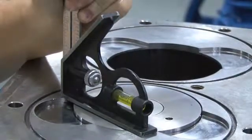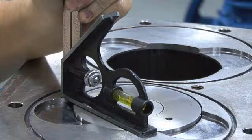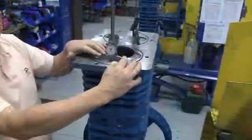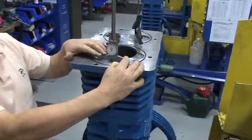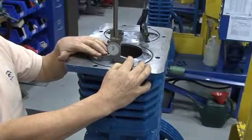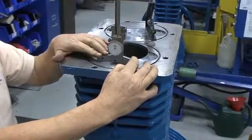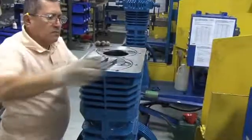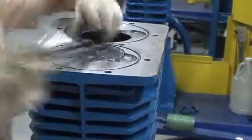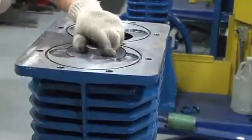If you have to make adjustments to the piston clearance, it is better to adjust towards the maximum clearance rather than the minimum. That concludes the quick yet easy and extremely precise methods for measuring piston clearance on a Blackmer reciprocating gas compressor, making sure it falls within the proper tolerance range. Please note that the piston clearance for every model is different. Consult the IOM for your exact model to determine the proper piston clearance. Changing the piston clearance requires removal of the piston lock nut and piston to access the piston shims. This is detailed in the packing replacement video.